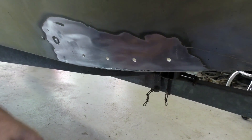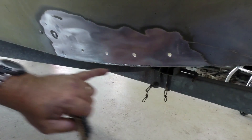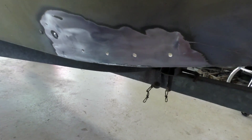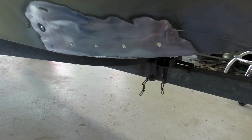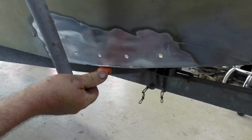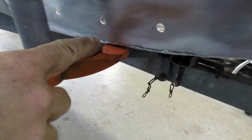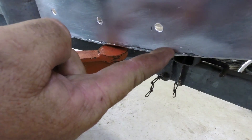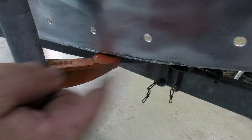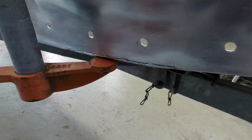About as good as we were able to get it. I suspect we're still going to have a bunch of junk in there, but honestly there's not a whole lot more we can do without just making a gigantic opening. I really don't want to do that because I'd like to be able to pull this back to its original shape. What we're going to do next is take a furniture clamp, put it right here, pull this back together and just hold it. I've got that nice and tight. I'm just going to put a couple of tack welds on here to hold this in position, and then we'll probably reset everything and maybe flip the boat on its side to do the welding.